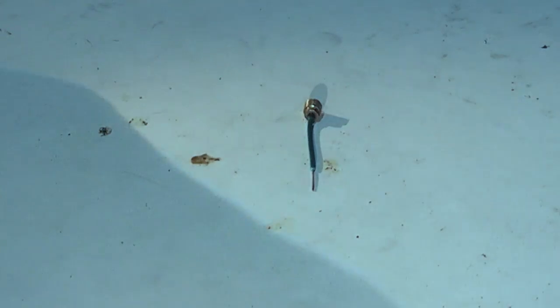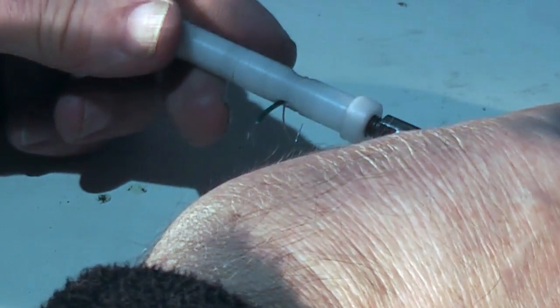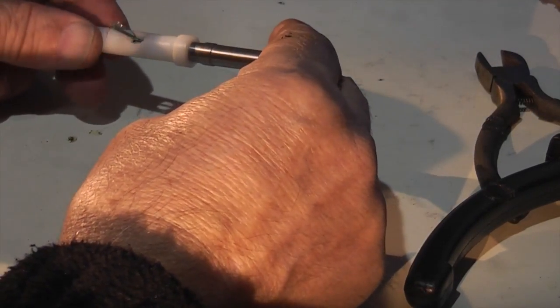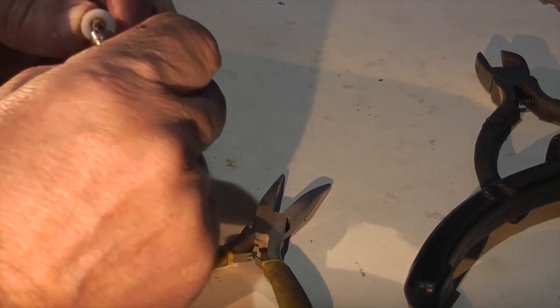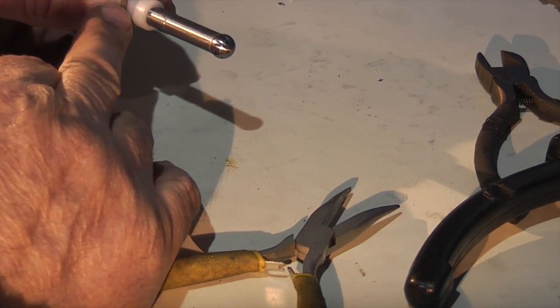We can thread the wire through so it comes out the side hole, and just push the brass part home — same on the other end. When you screw the ball probe in it should come just up to the face. You may need to take some off the end of the thread so that it will screw in and tighten up on the face, not the electrical contact.